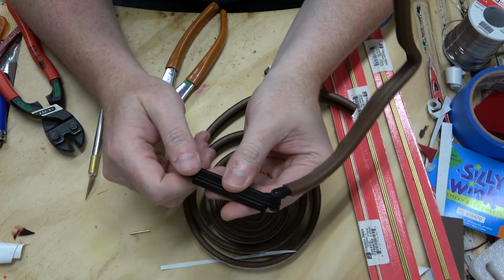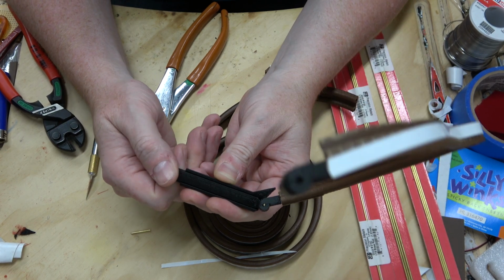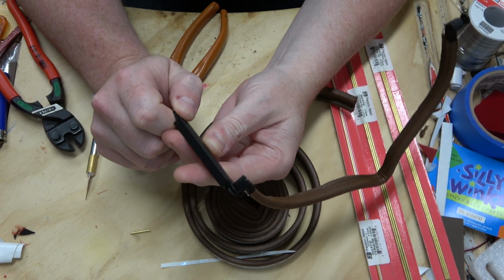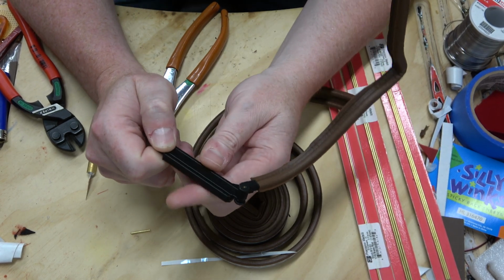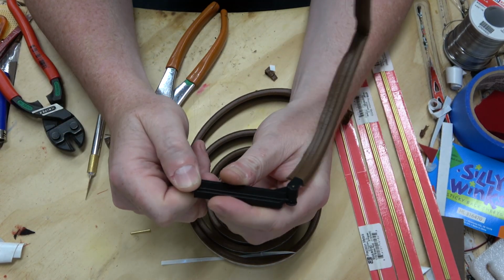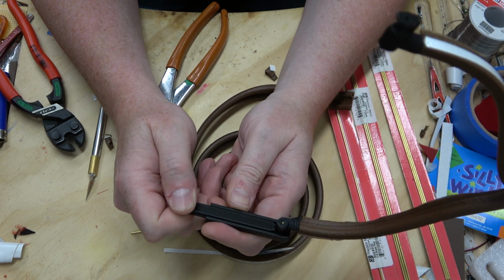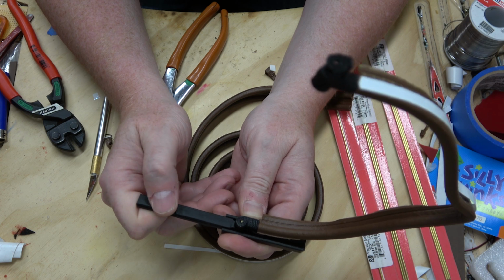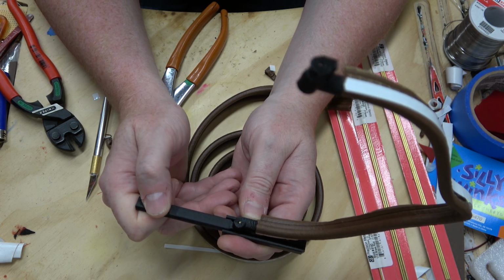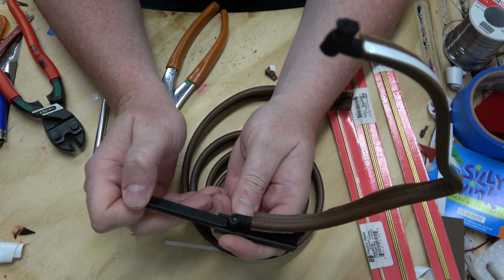So, in the pursuit of elegance, I'm thinking about doing, I don't know if it's going to work, a rotating rack and pinion. This is my simpler idea. So we have a linear rail with a trapped slide in it, and then we use everyone's favorite form of free energy, gravity, to pull the mast down. See? Flops down like that. And then if we put a rack and pinion here, we could actuate a gear and then pull this, I don't know, 60 millimeters back. Although we're going to be running into the limits of how far a servo can go.